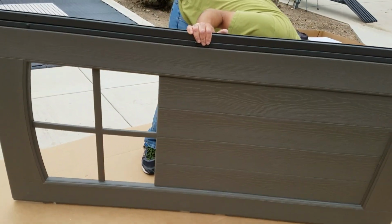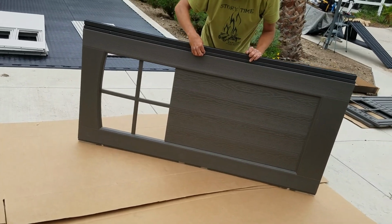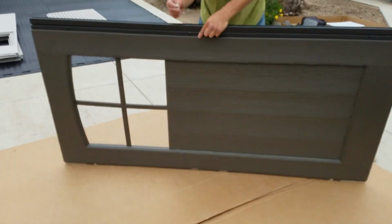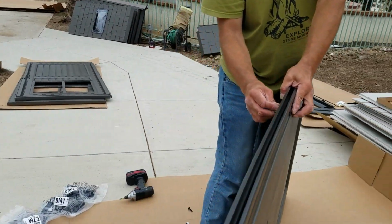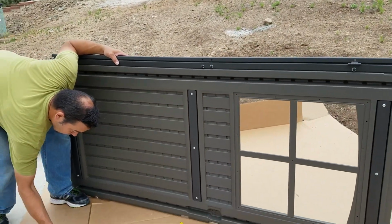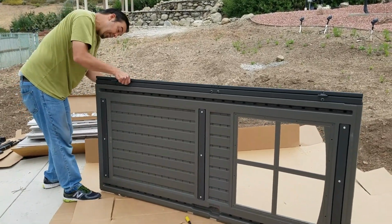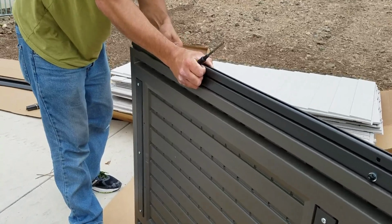If you're tightening them as you're going along, you'll see it's just tightening things down, and you won't be able to get the next hole to wiggle room to move it around because everything will be so tight. So yeah, that's a typical procedure with most of this stuff. You put all your bolts in loosely so that you aren't fighting yourself getting the bolts through because everything's been tightened. Anyway, you just run all 4 through, hand tighten them all, and you'll come back later and just snug them up so there's no loose washers and it's on there.